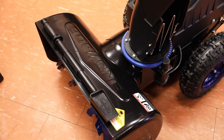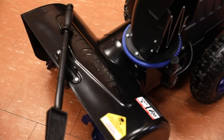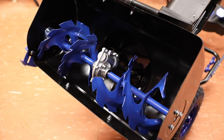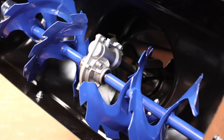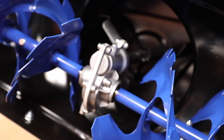On the front we have your two-stage augers. This model is painted black to indicate it's the second generation. The entire front area is all metal construction — Snow Joe has their logo engraved on top, and they include a little shovel in case you have large chunks of ice stuck inside. Up front you've got the gearbox in the center and two large metal serrated augers in blue, plus shear bolts on each side to prevent damage to the gearbox and motor. You can adjust the height via the glide shoes and the blade on the front, and inside you can see the front and rear augers — which is why they call it a two-stage.